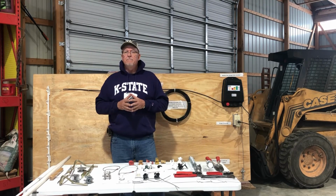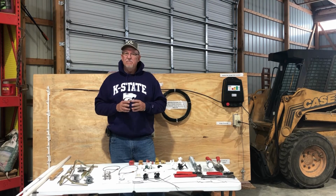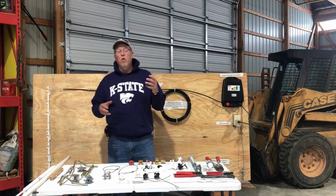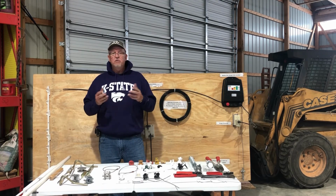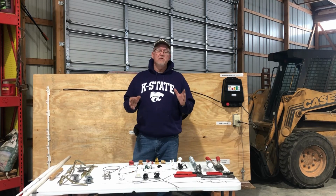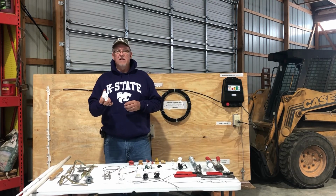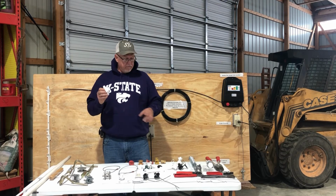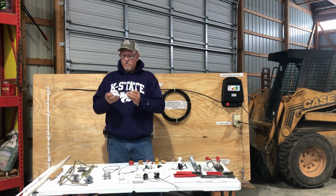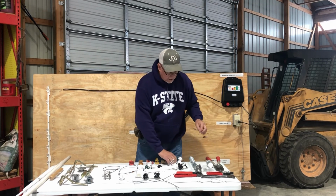So find you some of these 10-year warranted insulators, and then look also, if you look here on the table, what color are most of these? Most of them are white or black. And those are what you're going to find typically are going to have the best UV protection. One thing that you do not want to use if you are using high tensile wire is the claw type insulator, okay? The high tensile wire is so stiff that you can't bend it to get it to fit in here, okay? So don't use the claw type insulators.